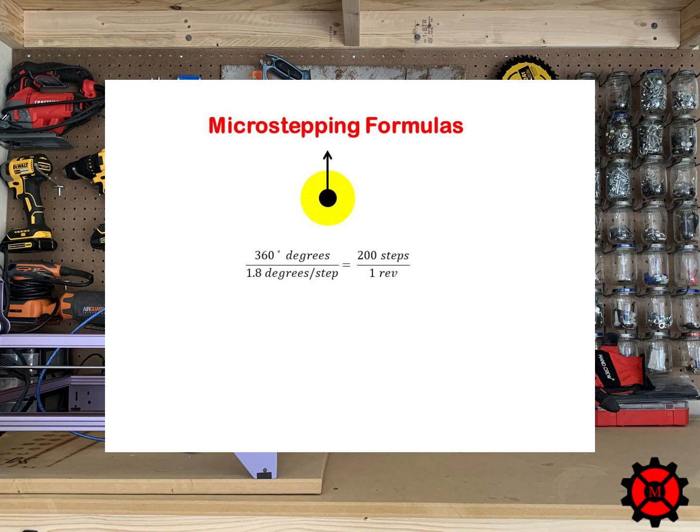Now let's set up the steps for our stepper motor. We know the NEMA 17 unipolar motor has a 1.8-degree step resolution, and if we divide 360 degrees by 1.8 we get 200 steps in one rotation. When setting up a stepper motor it's important to know the microstep resolution, which is set on the board using jumper pins and also in the firmware. The microstep resolution affects the steps per millimeter needed for that motor, which is also inputted into Marlin.